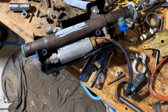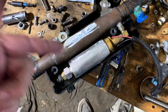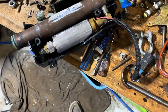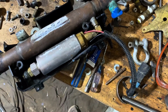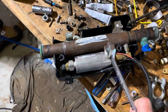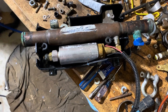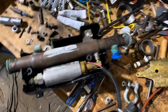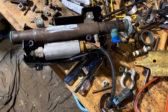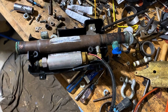This is how you restore a Mercury Cool Fuel system. I'm about to put it all back together, mount it on the engine, put JB Weld on the regulator, and see if I can salvage the whole thing and make it operational. I haven't even tested this fuel pump - I took it out, looked at it, cleaned it up a little, and didn't see a lot of corrosion inside the pump. By the way, if you put 12 volts on a pump and it doesn't spin, lightly tap on it with a tool - sometimes the tapping will free up the brushes and it'll start working. That goes with any electric motor - even a starter - the vibrations can jar the brushes and make it start working.